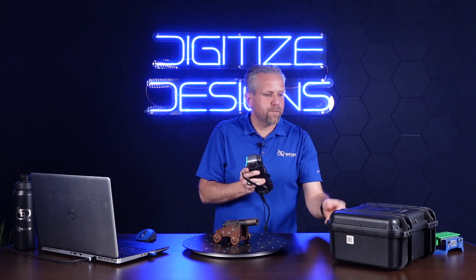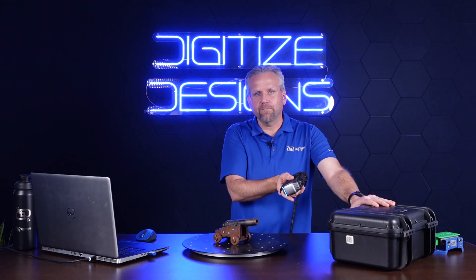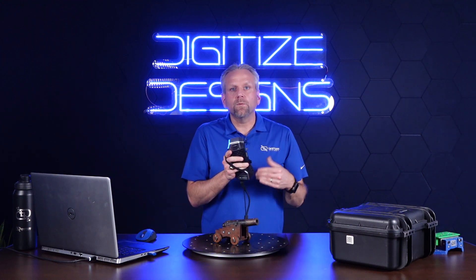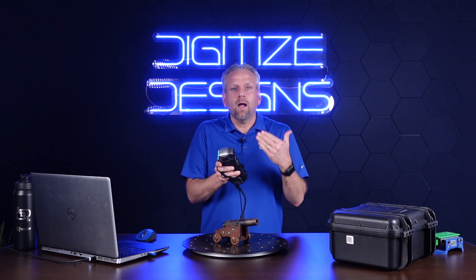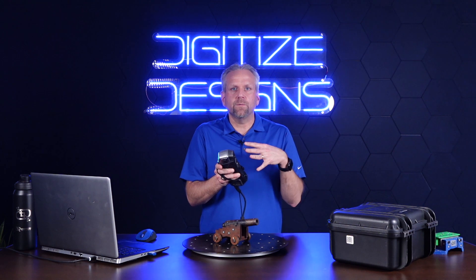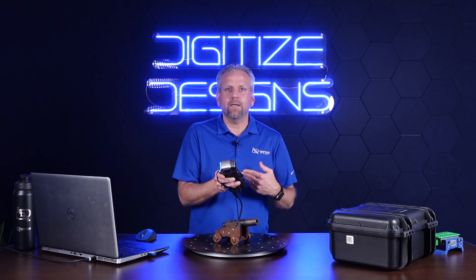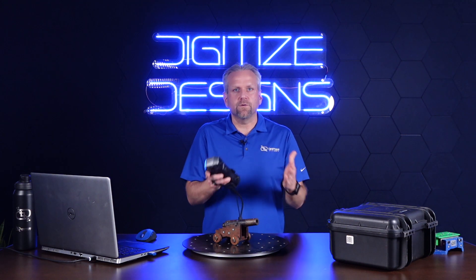The case is very small, making it very easy to transport — to take on an airplane, for instance. This works with crossing blue lasers. Blue light lasers are basically the state of the art of this technology. Traditionally they were red lasers, but red lasers are much more sensitive to shiny surfaces, especially dark black surfaces, chrome, and so forth. Blue light lasers like this one are actually much more adaptable as far as the surface conditions go.